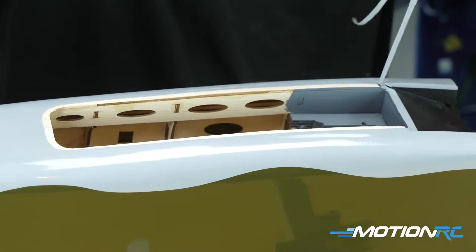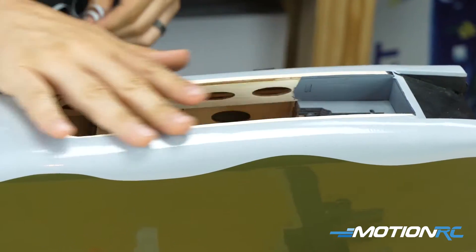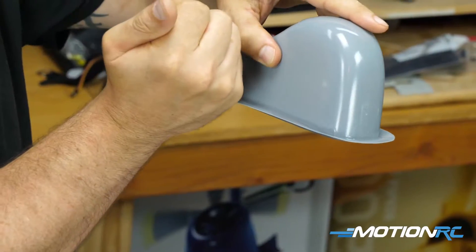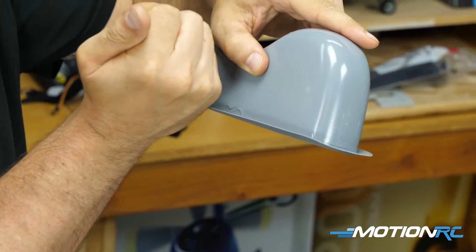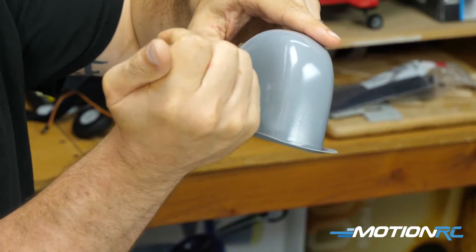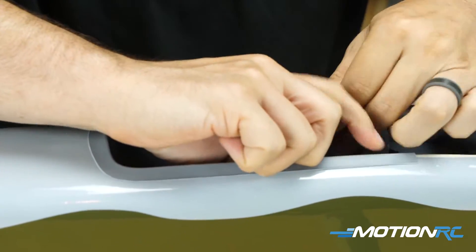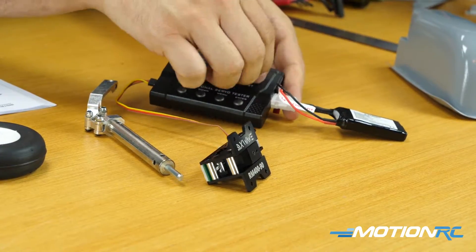Where they've painted it gray, leave that monocoat on. I didn't do that so I can see a little wood — I'll have to go back and paint it later, but no big deal. Once you get that done, take some thick CA, put it around all the corners going around it like you're decorating a cupcake, slot it in, and hold it in place until it cures.